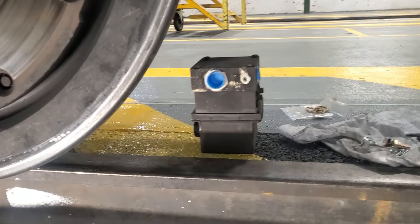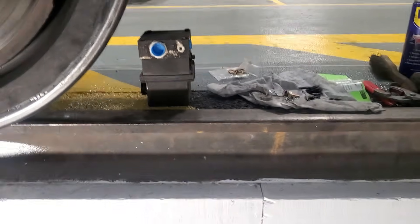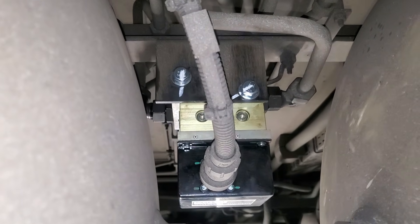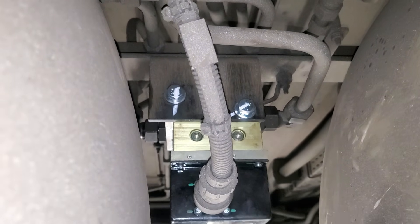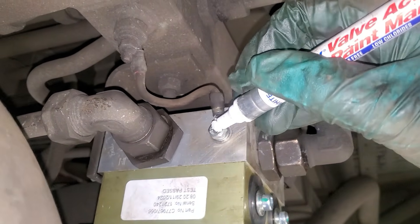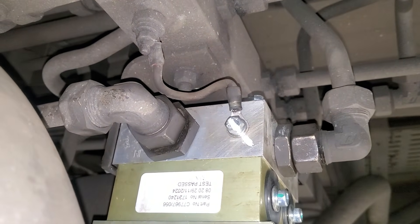On the old one I've got to write the serial number on the label because it gets sent off to be overhauled by another company. We also put a white marker - they call it a witness mark - so when they're doing their inspections they can see if the bolt has turned or not due to vibrations. Let me witness mark the earth as well. That's one of the rules on trains - all the bolts have to be witness marked.